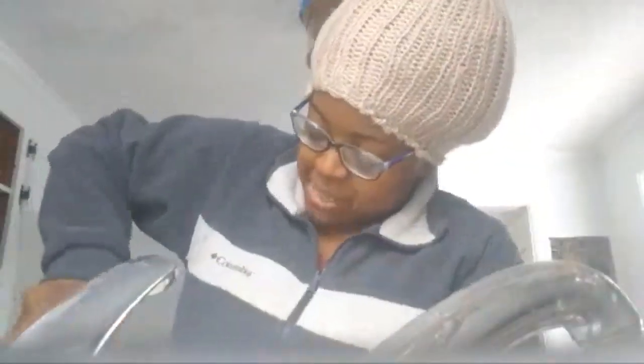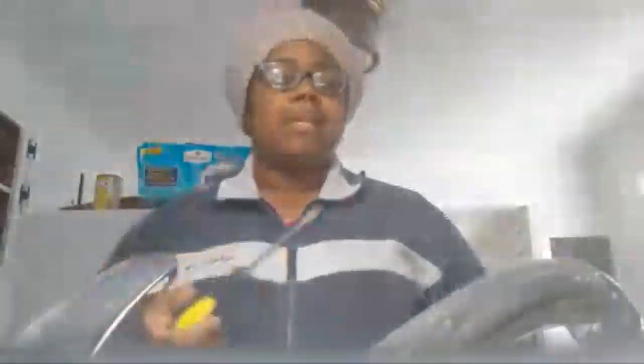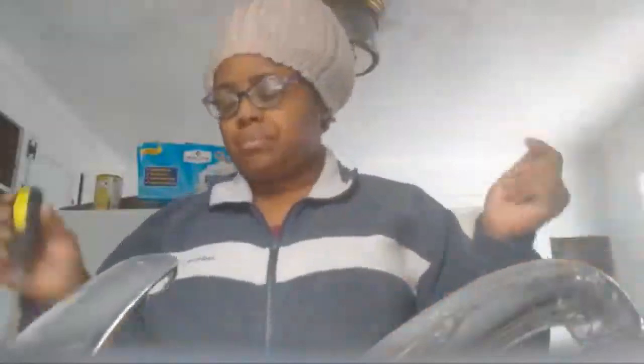But when my kids put stuff in the kitchen sink or the bathroom sink, though I've only done it in the bathroom sink, I just take the pipes loose at the bottom of the sink and get the clog out. So normally, if there's water in the sink, you dip all the water out of the sink, you put it in the toilet, and then whatever little water is left at the bottom of the sink that you can't scoop out... Let me show you.